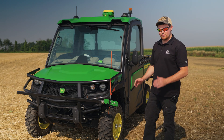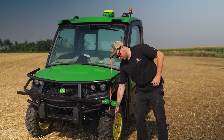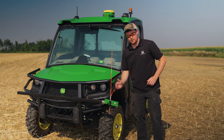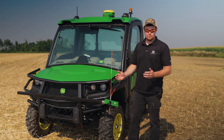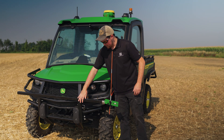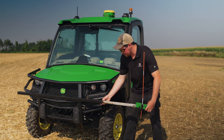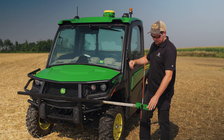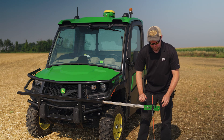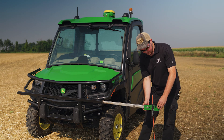There are a couple different ways you can go about recording your boundary. Some guys will go just off the outside of your tire, so as long as you keep it along the outside, you're good. In my case, I'd like to be able to see where exactly I'm recording from. So I've set up this bar on the front, extended to a length so when I'm sitting in the cab, I can look out the side and see where this little yardstick's sitting — just a simple yardstick from home hardware.